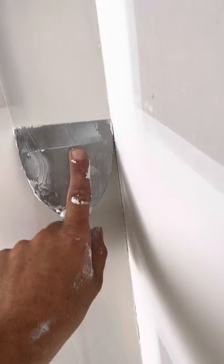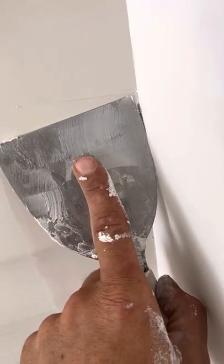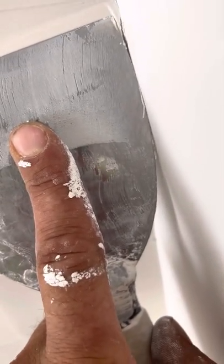You can get all the goobs out. Now we've got some goobers on the other side — he did dig out the other side of the angle here. You can feel it with your hand — you'll be able to feel where it's gouged. That's going to be a point up there, no way around it. But you can still make this a nice square angle. You don't want to leave stuff like that, so we're going to come down one more time and fill in the places. You want to keep that knife 90 degrees — you do not want that knife angling in. If you see the gap between the blade and the angle, this part right here is going to cut into that side of the angle, which creates literally a divot in the other side. This is a little bit better.